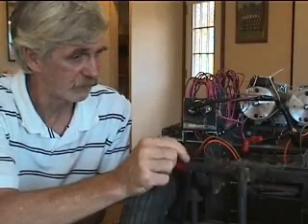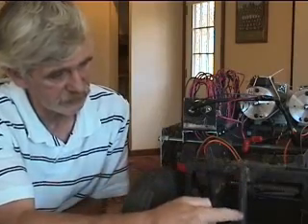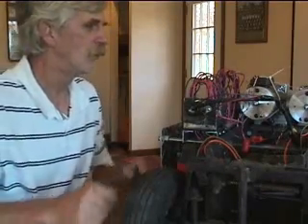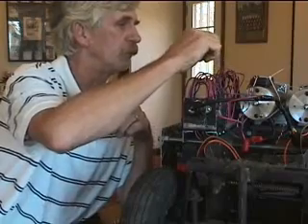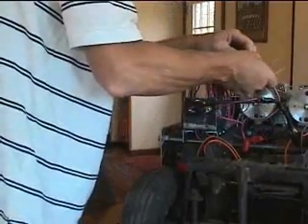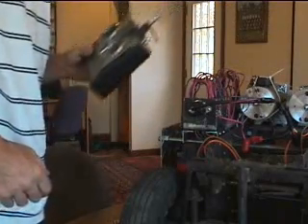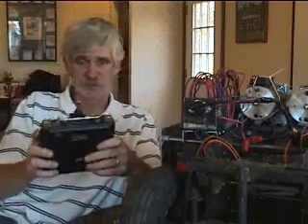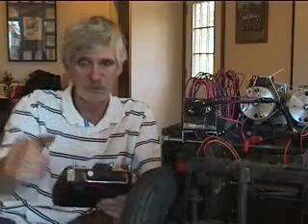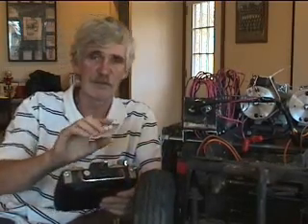It's got the electric seat motor involved in here, and then it has the track here. I have this bar welded onto the front of it, and it just turns the steering right here. Maybe I can plug it in right here to show you. I'm going to plug in my receiver — it's a regular airplane receiver. I just plugged it in there, and there's a little bit of chatter — maybe adjust that later. But I want to demonstrate the front wheel mechanism, how that works. It just turns like that, basically. Don't be fooled by that — it's very strong.